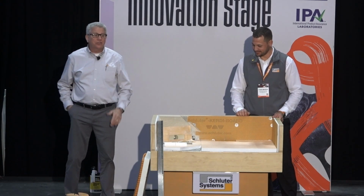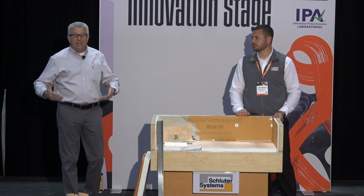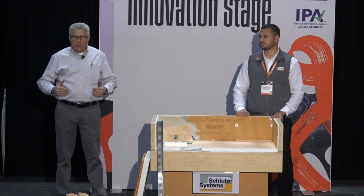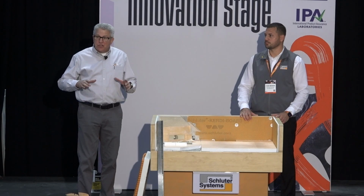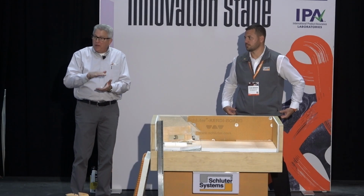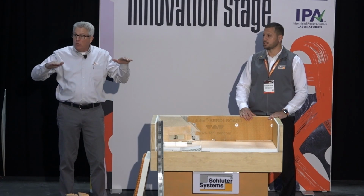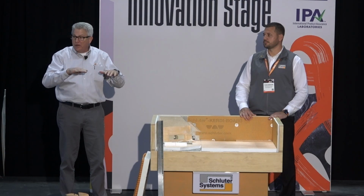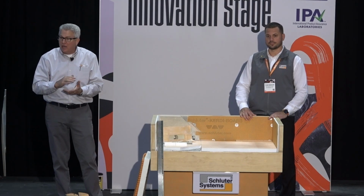We've had drains out for quite a while. Matter of fact, Schluter Systems is known to be the pioneer of bringing out an integrated bonding flange, and what that did to the industry really changed things up. Prior to Schluter's integrated bonding flange, called the Kerdi drain, the only drains afforded to us in the tile industry were from the plumbing industry, designed to go under the mortar bed at the clamping ring, under the mud. What the tile industry really needed, because we were trying to move towards surface waterproofing versus the old water in, water out pan liner type, was a drain that accommodated the surface waterproofing up at the surface, not underneath the mud job. So that's when Mr. Schluter developed the Kerdi drain.